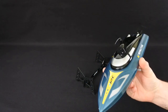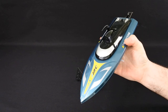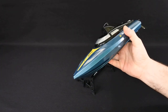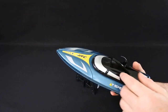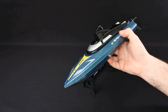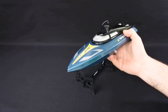Okay, so you saw it in the water, and as you can see, this camera is useless. The problem is it's only running at a bit rate of 1.2 meg — it's 720p, 25 frames a second — but as you've seen, it's so choppy, it drops that many frames, it's untrue. And the black blob in the sky, if you wondered what that was, that's the sun. It can't handle the sun at all, it can't handle going from light to dark, and there is no way you can drive or sail this in FPV — it just breaks up far too much.